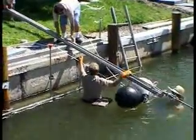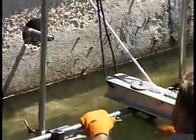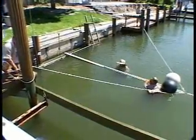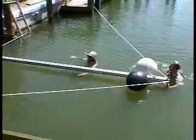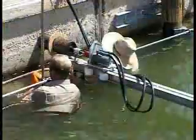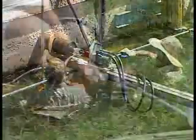Next, our rail is secured with guidelines and flotation devices are placed into the water. It's screwed into place and aligned. We then secure the end of the rail and prepare for the hydraulic setup. Once the carriage has been laid in place with the coring bit installed, we turn on our power unit and begin the drilling procedure.